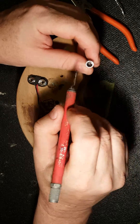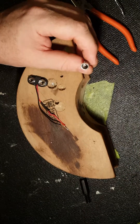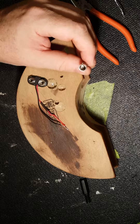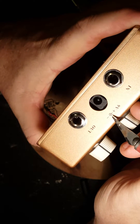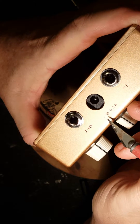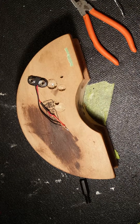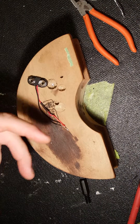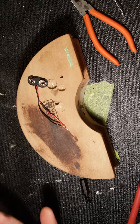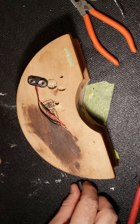It's very important that you determine if it's center negative or not. Usually you look at the pedal and it'll show you — you can look at this one here. There's a little diagram: positive shows the ring and negative shows the pin, so this one is center negative. Because if you get the polarity reversed, you can damage the pedal — pretty much destroy it — especially with a vintage pedal.